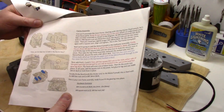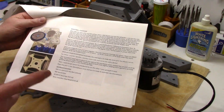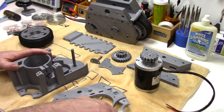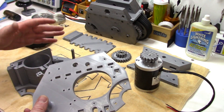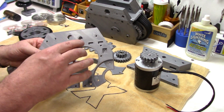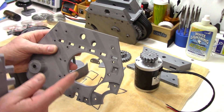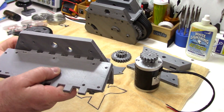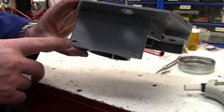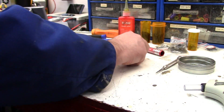These go together quite easily — just follow the instructions. There are a couple of little gotchas and we'll go through them as I get this second foot together. You can't just snap this together; it depends on the accuracy of your printer. My little printer has really tight holes for some of the fitment, so I had to file these tenons down to fit into the mortises properly. You still want a nice tight fit, but that's about it. You'll find lots of little inserts all over the foot for the square nuts.